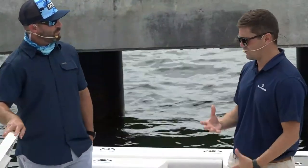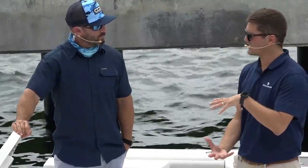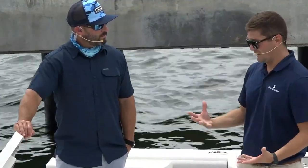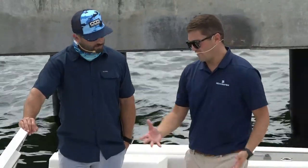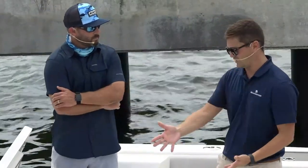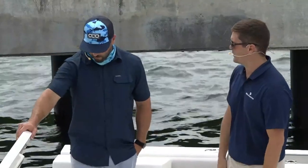Yeah, and so getting back to the innovative cooling system, it's a seawater glycol exchange. Obviously, we talked earlier about heat dissipation. We have to get the heat inside the unit out, right? Being inside of a vacuum limits that heat, but there's still some heat generated when you're spinning something at 9,700 RPMs. So we have a seawater glycol exchange that pulls heat away from the unit and uses a heat exchanger to dissipate the heat from the unit.